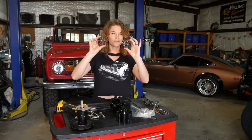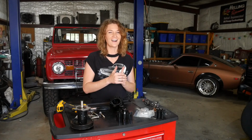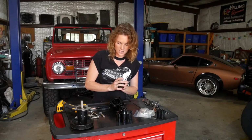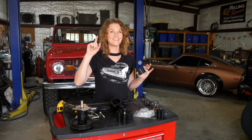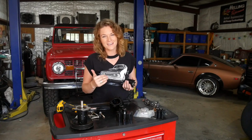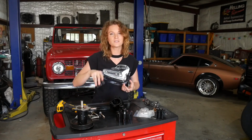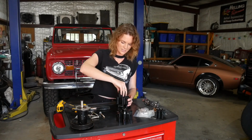Old versus new. So, one of the videos that I watched, Eddie, awesome New York accent, he said to hold the fins around and really work hard to get it in the housing. And as I was watching him, I was thinking, I either want to wrap some rope around that or a zip tie. So then I read in the comment section that pro tips were thrown out that you should use a zip tie to hold your fins down the direction that you want. It rotates counterclockwise. So hold the fins down with a zip tie and then you can easily get it in.